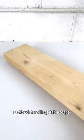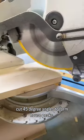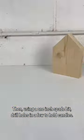Here's how to turn stock lumber into a rustic winter village tablescape. Using one and a half inch thick boards, cut 45 degree angles to form house peaks. Then using a one inch spade bit, drill holes in a few to hold candles.